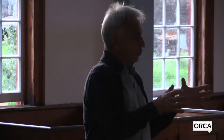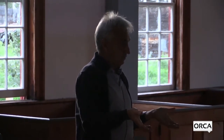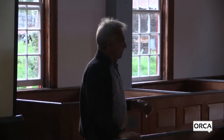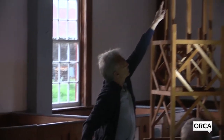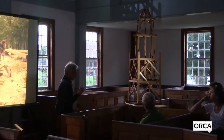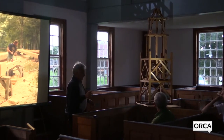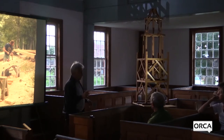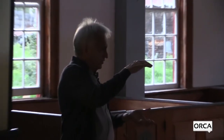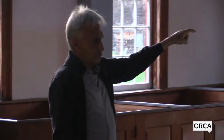So the mast once sat on something else. Maybe water came in and ran down the mast and rotted that. I don't know. Or the little roofs above it rotted it. The 8 posts that surround the mast also come down almost as far as the mast, but not quite. They sit on the top of a collection of loose blocks, 3 blocks sometimes. In one case, one of the blocks is a cut-off piece of one of the posts.